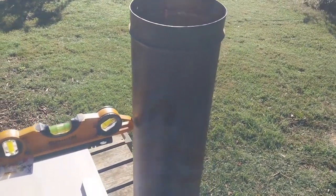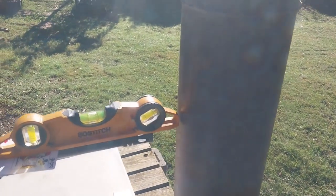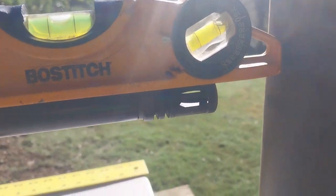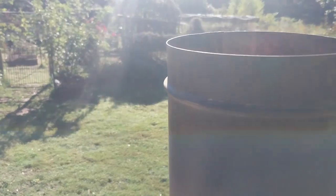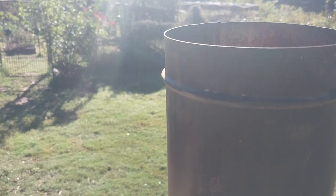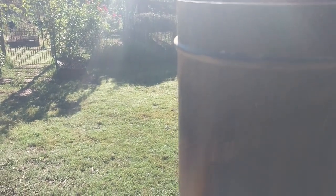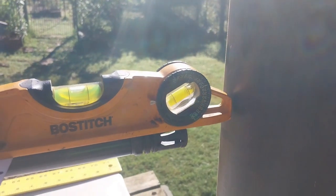I've currently got it upside down because I want the damper to be on the bottom side of it. The measurement from the hole-making machine is about nine inches and I've got that measured carefully. I can always raise or lower this before I drill it and self-tap it into the flange on the stove. It's got a really nice long four or five inch collar that this slides over, so I've got a little liberty to go up and down.